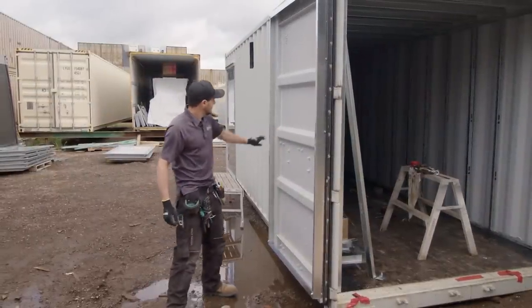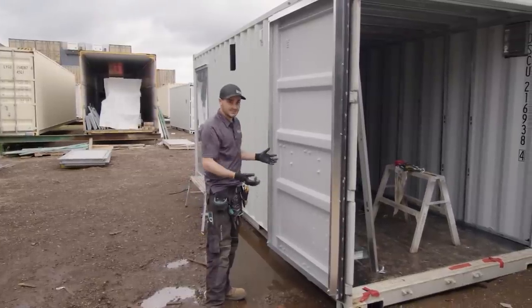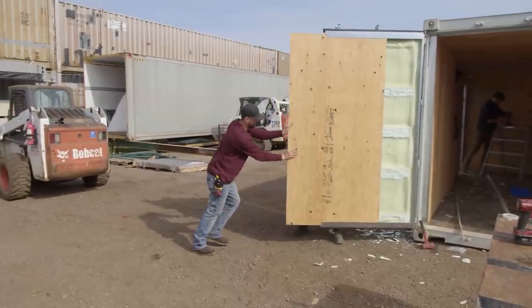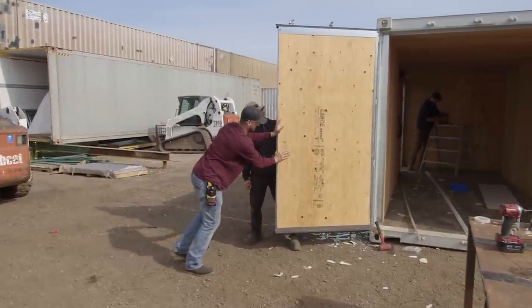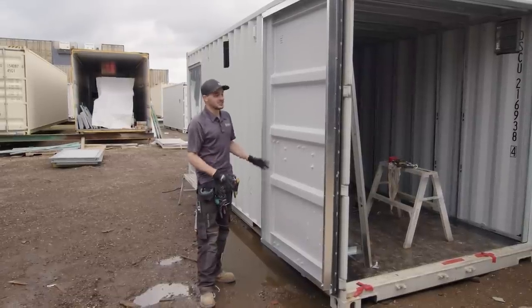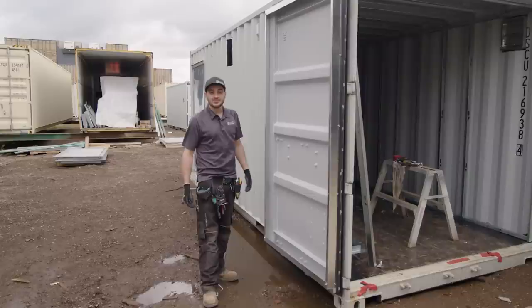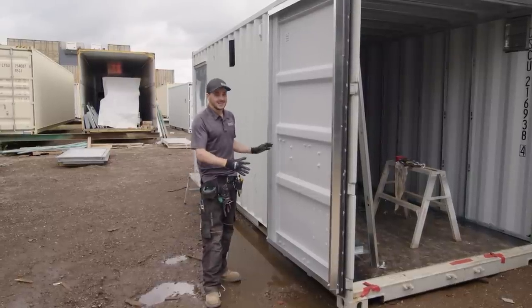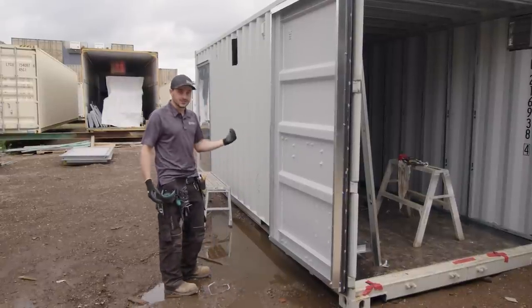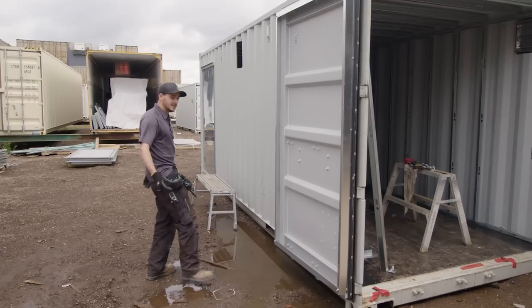This door flashing kit is installed — we'll tape off on this inside edge here, and when the spray foamer fills this with foam, we can remove one of the side sections, slide in your interior wall covering, reinstall this, and screw it all on. Now we have a very nicely finished door that's actually usable, rather than just blowing spray foam all over the door and sealing it shut. This is the tidiest way to insulate your doors, give you the best insulation value, and also the ability to finish the inside of the doors just like the interior of your container.